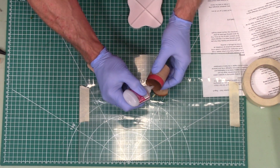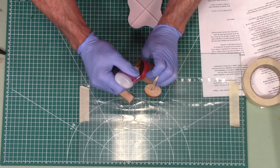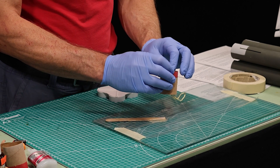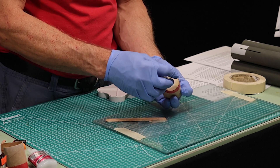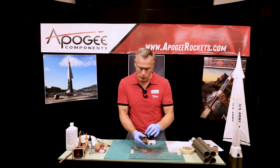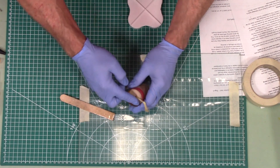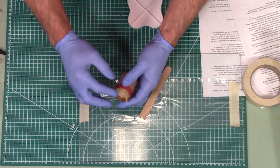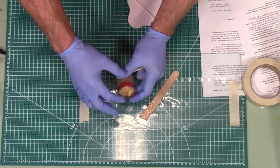It's going to be about one quarter of an inch from the front end, which is this red end — the reason for that is so that the knot doesn't go all the way to the top. Make sure that when you put it in it's not crooked. Make sure that the Kevlar doesn't get on the edge between the two, because it's going to make that bulkhead crooked and make this oval instead of round — we want to keep it round. Take the epoxy and go around on both the front and the back, putting a fillet on both sides. Then take this and put epoxy on that and press it down against the upper surface. In 15 minutes this will be nice and hard.